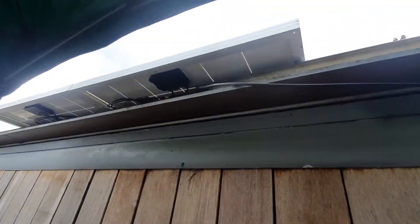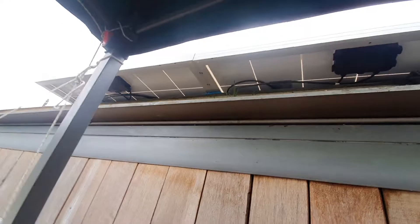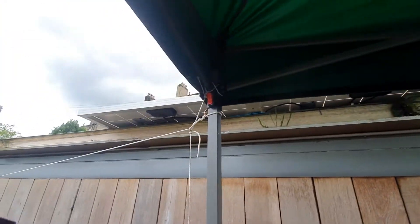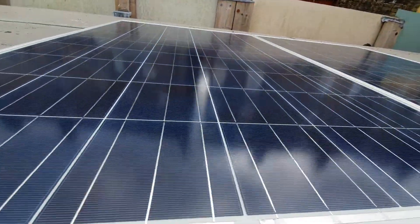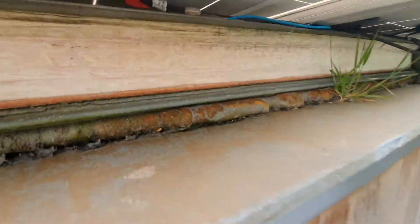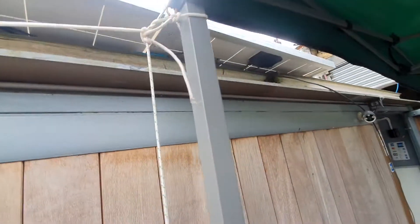Out here I've only put these up temporarily — I've got two times 245 watt panels. Let's just have a look. We've got no sun, although it's a little bit bright. I wired them at 38 volts each so I've got 76 volts out.